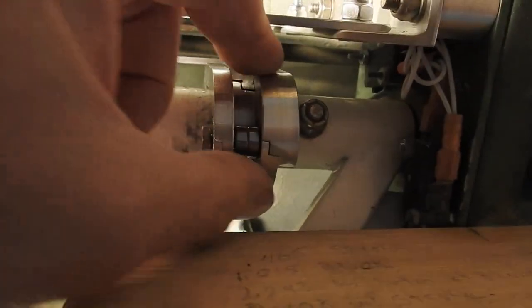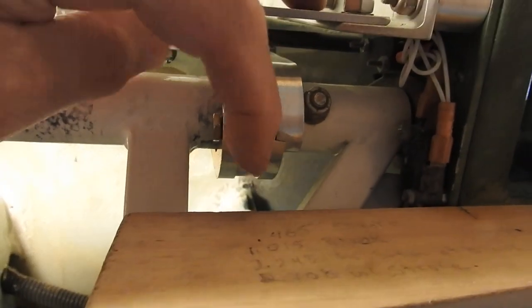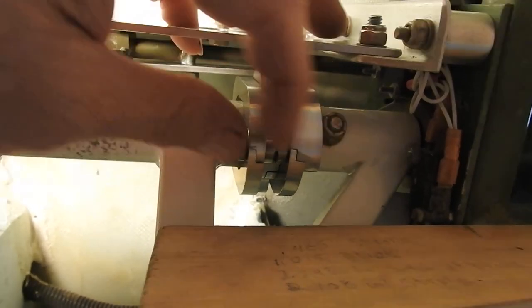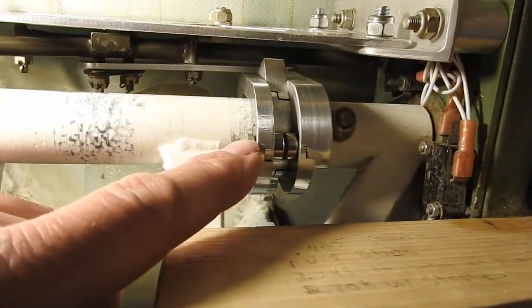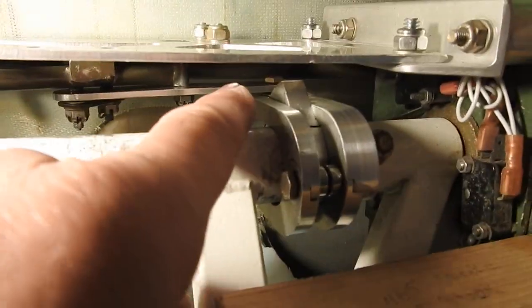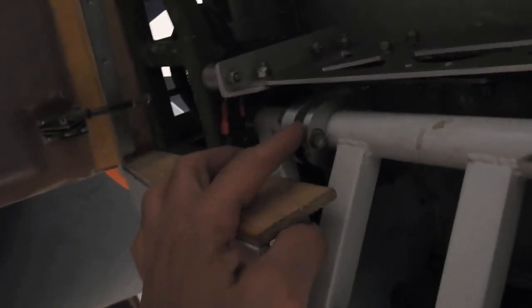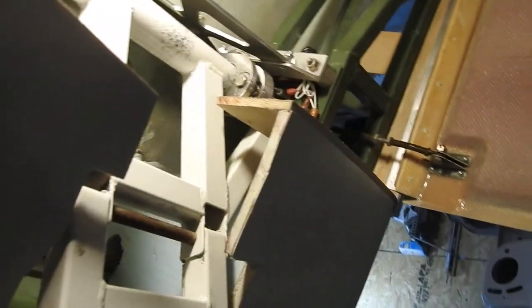There's going to be just a little play in it — I need to make some spacers because two of the bearings don't quite come up to half inch, and without a spacer I can't tighten it down properly. This piece can literally only go straight up and straight down; the rod end keeps it from moving forwards and backwards, and the cam keeps it from going side to side. I got both sides done. The gear door on the other side is on the outboard side in the same configuration — everything's done. All I have to do is get the doors back in and tighten up some bolts.